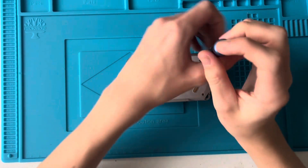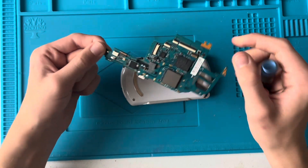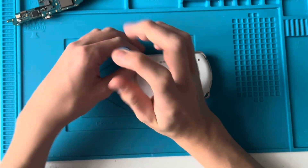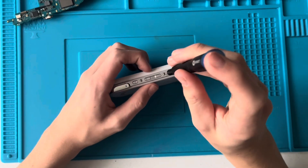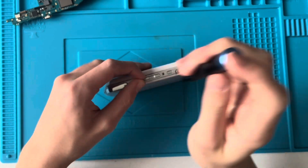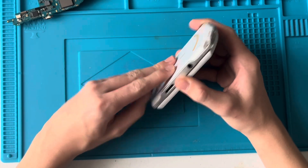Let's start disassembling this. If it is a fuse problem, I have got a PSP 2003 motherboard here that I will steal the fuses off and replace them in this. I'm guessing that since they're both powering a similar side backlight, the fuse will be the same. I know I've looked up where the three fuses are for the backlight. One of them is very easy to get to, one you've got to remove a metal shield to get to, and the other one you also have to remove a metal shield - it's very awkward to get to. But let's open this up.